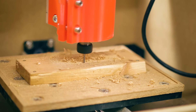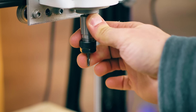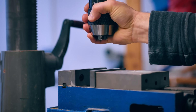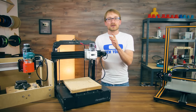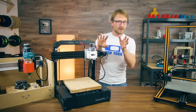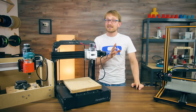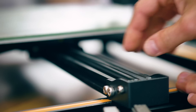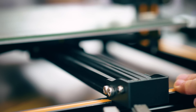Let's see what that force does with these machines. For reference, here's a Prusa Mark II, a CR10, Mendel Max III, Bob, and my glorified drill press milling machine — quite a difference. The floppier a machine is, the more it is going to deflect when cutting, meaning the more likely it is going to start ringing or doing other weird stuff that is completely inappropriate for milling. What also plays into this is that 3D printers typically use belts, and especially the cheaper belts are often incredibly elastic, which is the same as having a non-rigid frame in that direction.